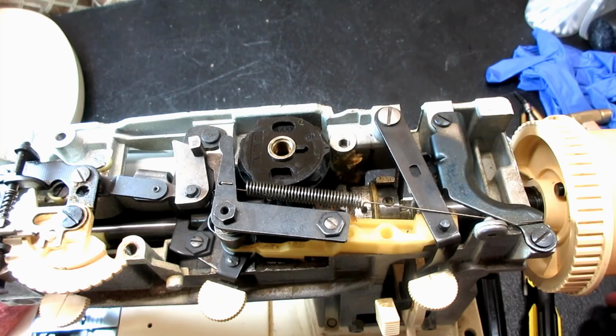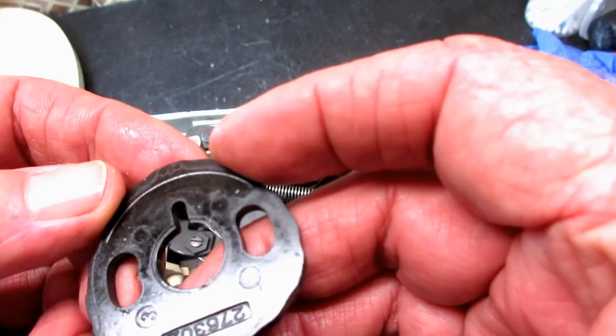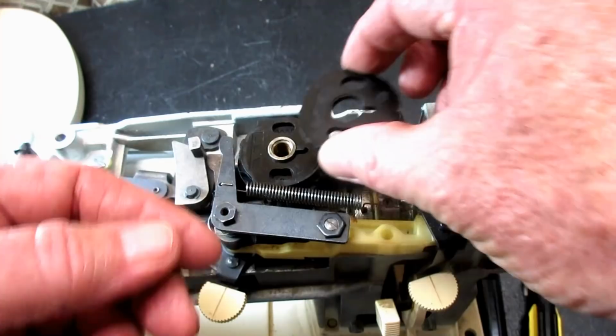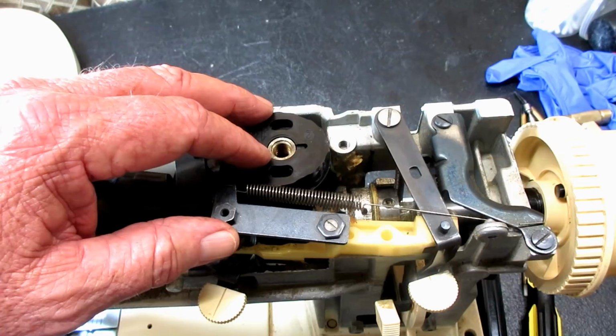And then your top cam on the 353 is the multi-zigzag. Where it does 3 little zig zig zig zag zag zag zig zig zig. And you put that on the very top. Now, if you have a 354, this is the 353 because there's 3 of these patterns.